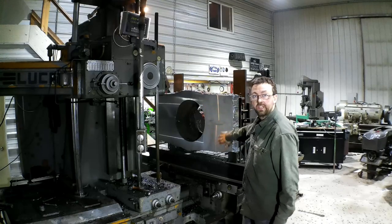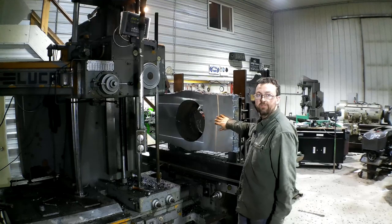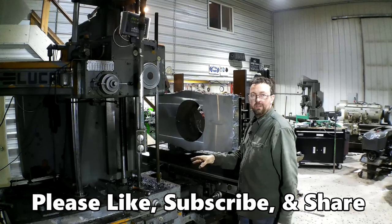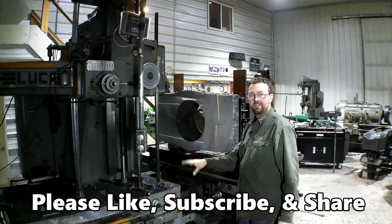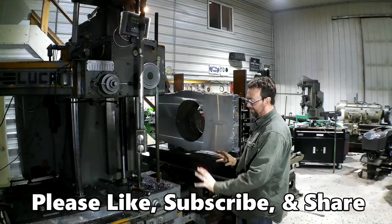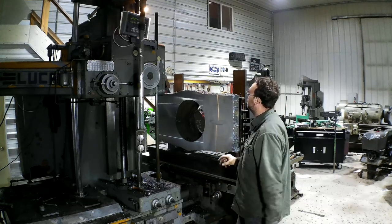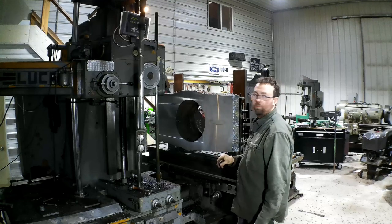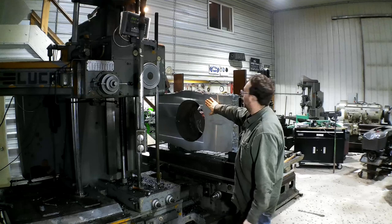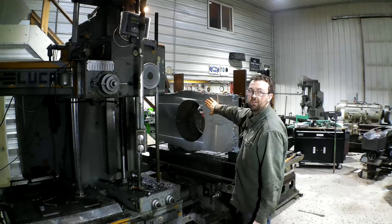That's a pretty nice finish. That's our first pass there, taking 125 thousandths. I'm not sure what RPM that is, because this machine never had the tag on it to say what RPM was, but I select one that I feel is a good speed. I was feeding 8 thou per revolution at 125 deep. I'm going to try taking 200 this next pass and see how it goes.